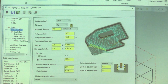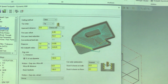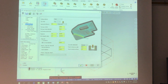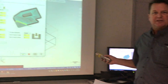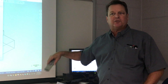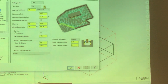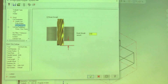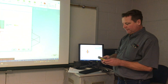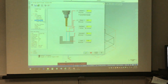We've started using the first pass offset in dynamic so it won't catch on a sharp corner — it will step back a little, only nicking the corners, and reduce feed for just that first pass. Gap size is left at 100%. We have a micro-lift distance of ten thousandths, so whenever the tool is not engaged in material it lifts up ten thousandths and then rapids back at 100 inches per minute to where it picks the cut back up again. We're leaving ten thousandths on the walls, and twenty thousandths breakthrough so when we flip the part the final time we're assured we've gone deep enough.